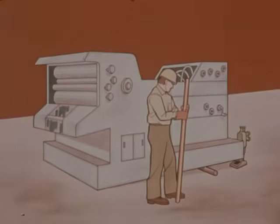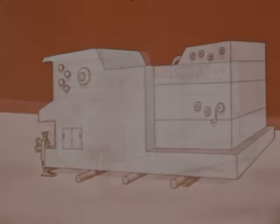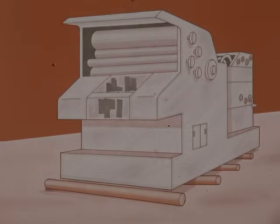When placing the rolls under a load, jack one end just high enough to place a roll about one-third of the distance under the load. Never raise the load higher than necessary to do the job. Place chocks in front and behind the first roll to prevent movement, and locate the jacks at the other end. Jack the load high enough to place a roll at the halfway point and another about one-third of the distance from the end. Place another roll at the head of the load so it will enter once the load has started to move, and clean the area in the path of the move to prevent the rolls from hanging up on small obstructions.